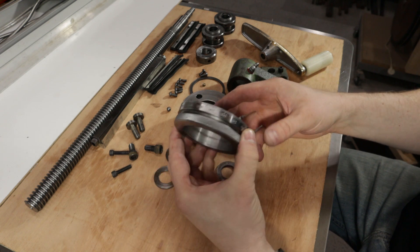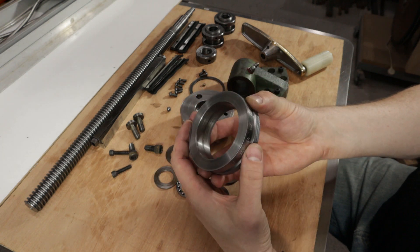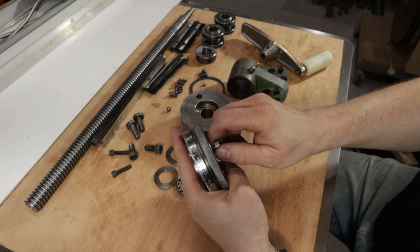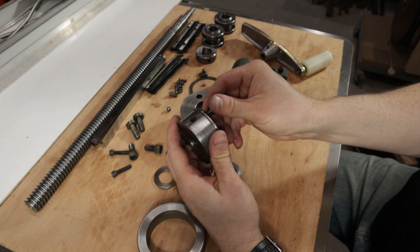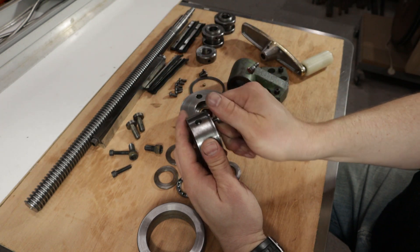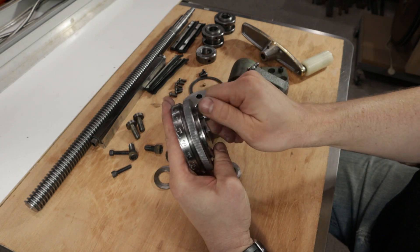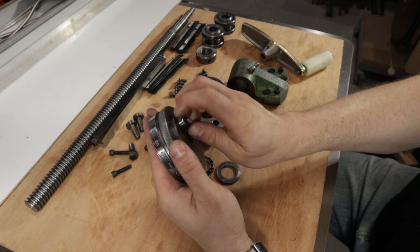And I've found a little issue. This graduated ring has a zero lock position. This screw is just a pointed screw and as you push it in it lifts the ball bearing up, and that grips the inside of that ring to stop them from slipping. So if I just nip that up, that's how that works.